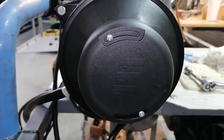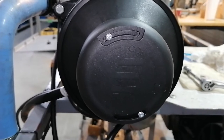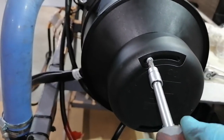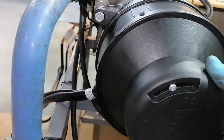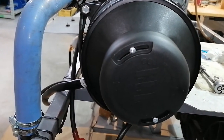The customer didn't send the front cover, so I will just use a new one. It is important to keep in mind that a cover and a burner must be considered a pair and should not be mixed between heaters because of the CO2 settings that are individual for each heater. For now we will just put this setting in the middle.